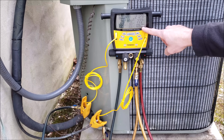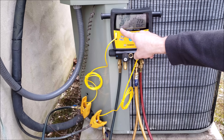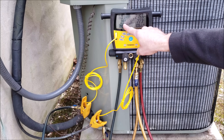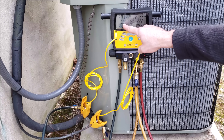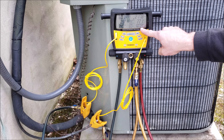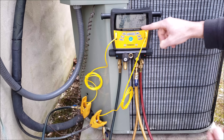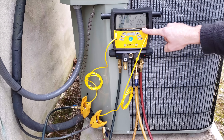The saturated temperature on the high side is above 105 degrees. Our vapor saturated temperature is very close to 32 degrees, and our superheat is very low. First thing we need to do is monitor to make sure the superheat doesn't go down to zero or 0.5 — that would be dangerous to the compressor. So we're going to enlarge the hole in the bag to drop the saturated temperature down a little bit.